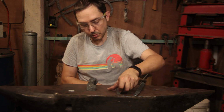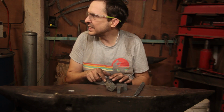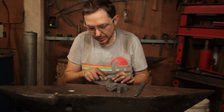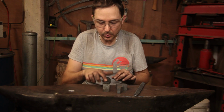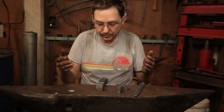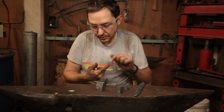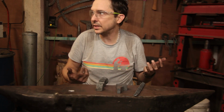There's a lot of extra work because this piece of axle, I don't know if you can actually see these, but it's got really big rust pitting, which took a lot of effort to forge out, and some of it didn't actually all forge out. So you have to upset as you drive things in so that you push the divots out from the inside, essentially.